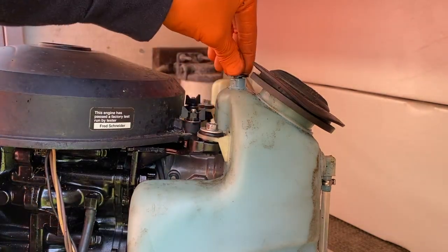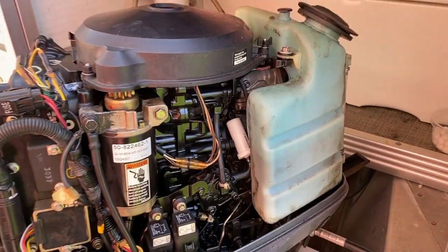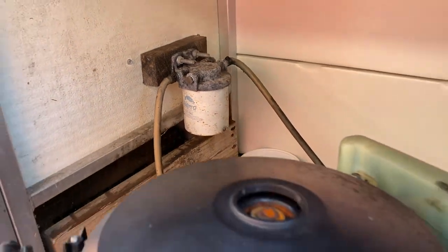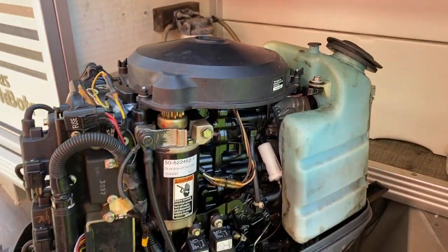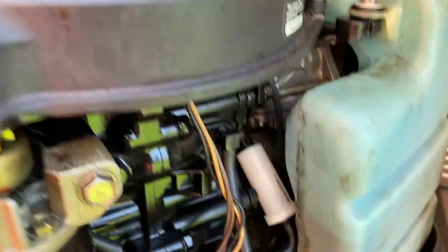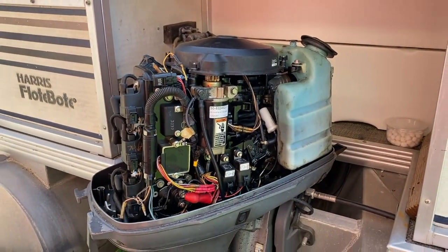Use the 10-millimeter socket and ratchet to secure these bolts and inner plugs. Do not over-tighten these, but you want them snug. Double check everything — the plug and the cap. Here's a close-up view of the brand new installed fuel filter. We hope this helps. We're also going to be replacing the fuel water separator filter shown there. If you do not replace that, over the years it's going to fill up with water to a point where it has no room for additional water — and that water will go through your fuel lines and into your engine, bogging it down. Your engine will be sluggish and you'll think it's having serious issues when really you just need to replace your water separator filter or the fuel filter we just replaced. If all looks good, we are going to start the engine and launch the boat and go for a cruise.